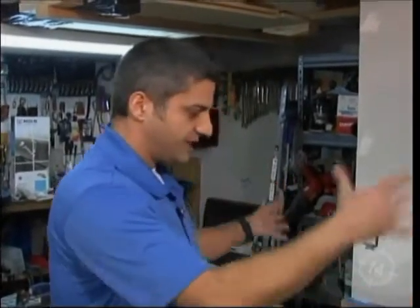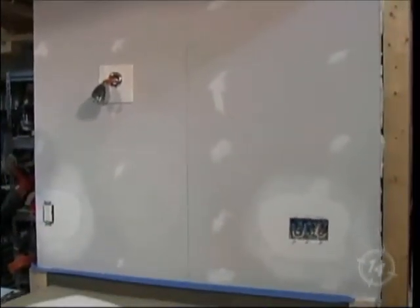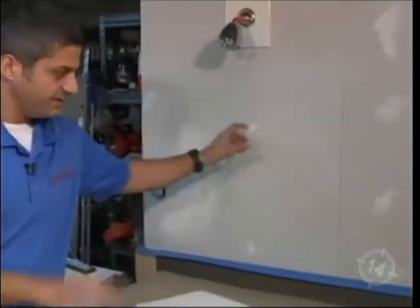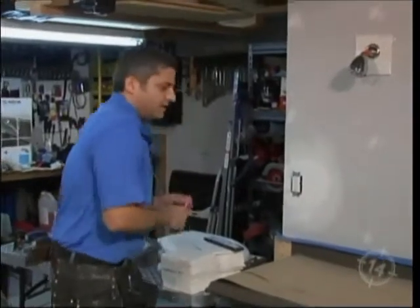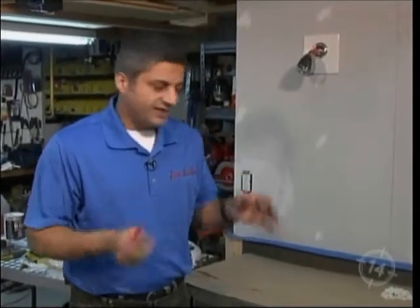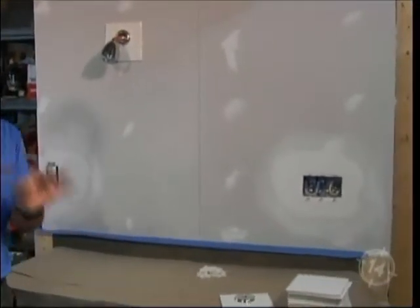If you just tuned in, today's show is about tiles. We have a simulation here — kitchen countertop, backsplash, outlets and switches. We've talked about the variety of products, when to use thinset for floor tile or tile in a wet area. In this particular case we're going to be using mastic, which is completely fine because it's not a wet area — it's only wall tile and you're not going to be stepping on it. The number one problem homeowners and even professionals get into when tiling is they don't take the time to do what I call a dry bond — a layout. If you don't do that, you'll have the problem of peeling off wet tiles or nothing lines up.